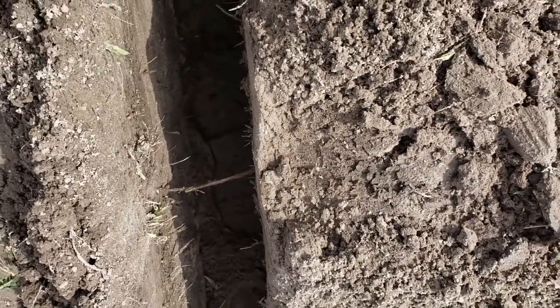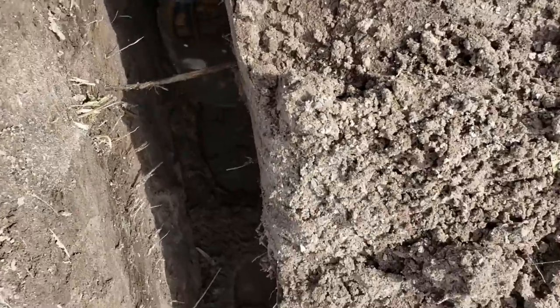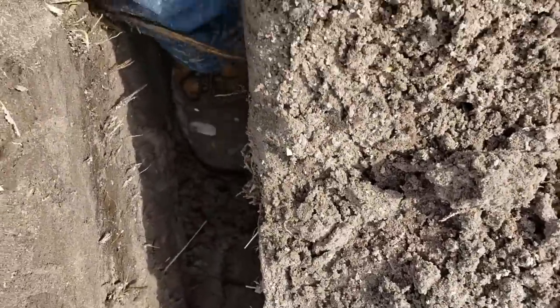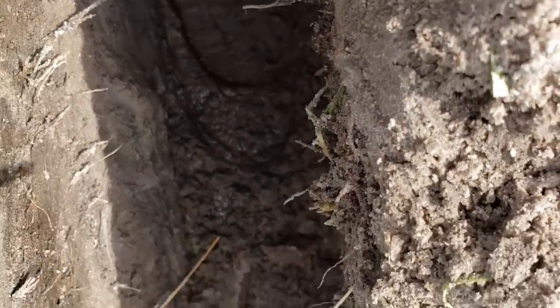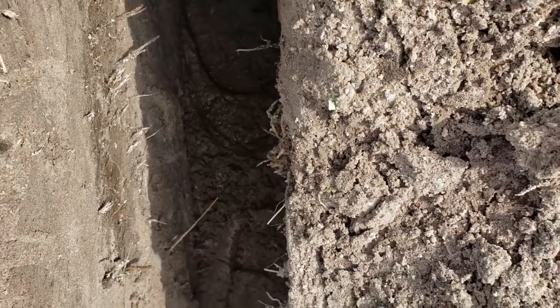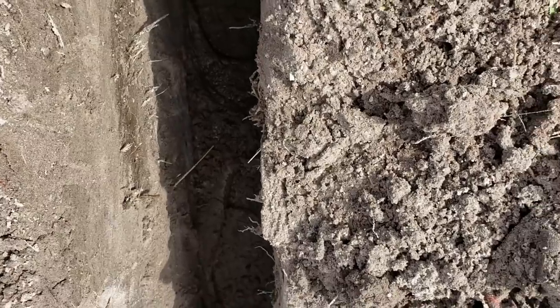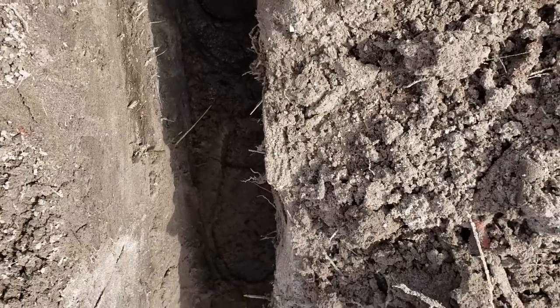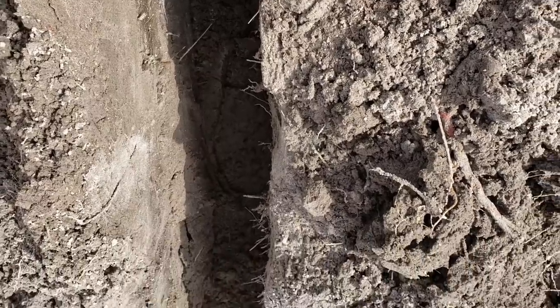To give you an example of groundwater — although you don't see it, listen carefully. Can you see that mud down there? This isn't even as deep as the original dry well. Groundwater is at different levels all through your ground. If you're going to use a dry well, you're going to need a whole lot of gravel. I think you're better off with a pump or gravity drain.